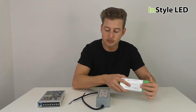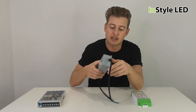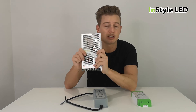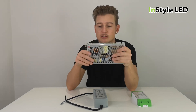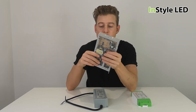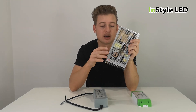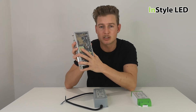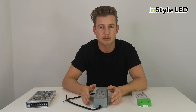To summarize: for internal use, use the enclosed end cap type; for external use, use the IP67 type; and for larger projects with racking systems, open terminal types are fine. But be careful installing open terminal supplies in home or restaurant settings where they can be touched — they must be put in a box by an electrician and all certificates checked.